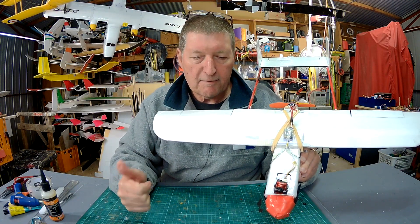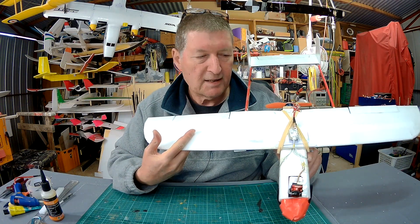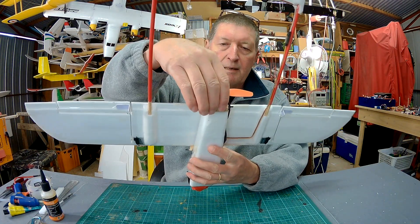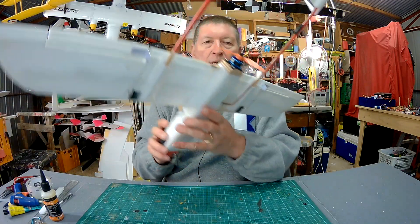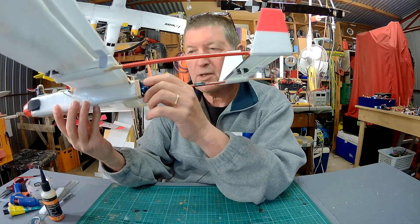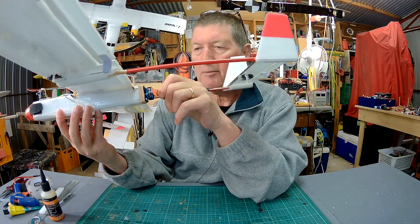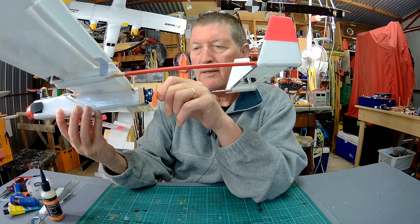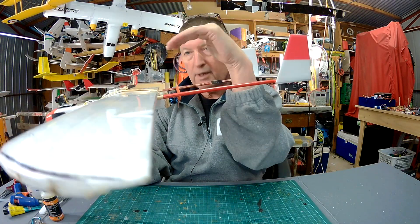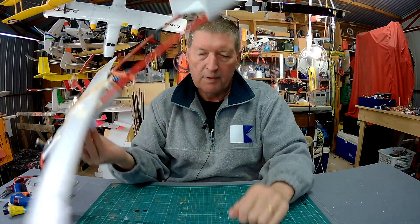Paul Gabanski and my flying buddy Michael Downey both pointed out that my knife was very blunt and I was tearing the foam. Thanks for picking me up on that — I'll fix that. Another flying buddy, Alan Moore, asked about engine offset for pushers. When the engine is in line with the fuselage like this, you really don't need much offset at all. You may benefit from left or right thrust angle, but up or down trim you don't really need for this design. If the motor is mounted up high, you do need to point the thrust angle down a little bit to stop the plane being pushed over all the time. Good question, Alan.